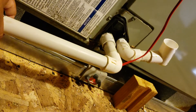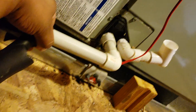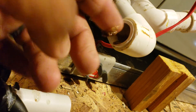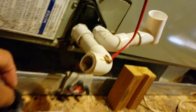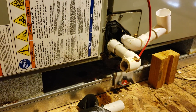So we're going to pull this insulation back and expose the PVC, then cut as close as we can and cut this 90-degree out. As you can see, this is the original drain line from 2007 and it's full of nasty gunk. The best thing to do is replace as much pipe as you can — if not, this guy is going to keep having call after call.